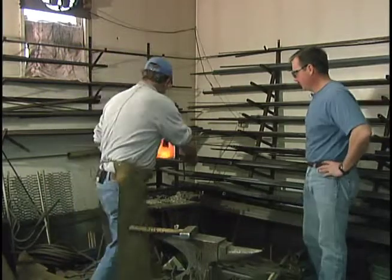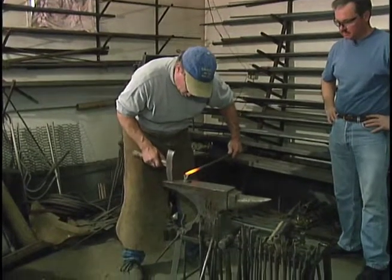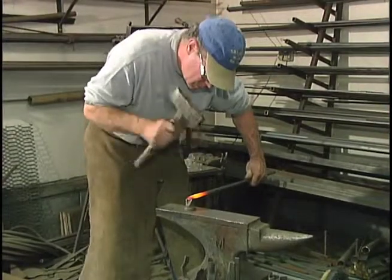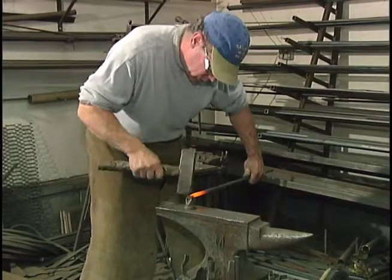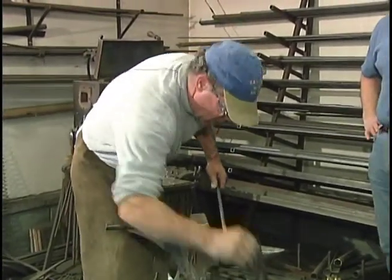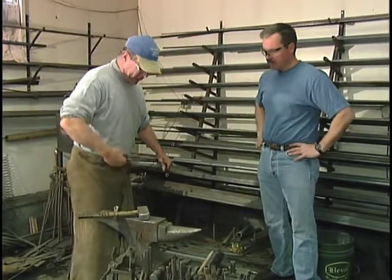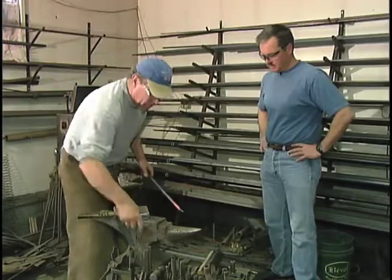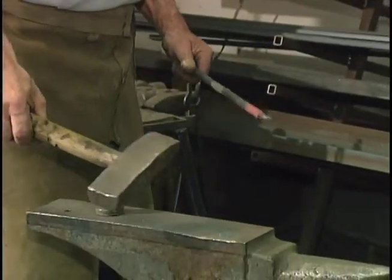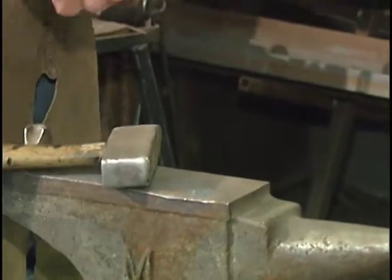Is that ready? Let's nip off a tiny bit of this. What's that tool? That's called a hardy and it's going to cut it. So that's definitely a traditional way of cutting steel. I have other ways of cutting — saws and band saws and bigger machinery. But this is what a blacksmith has probably used for the past few hundred years. Well, I only have two hands: one to hold the material, one to hold the hammer, and the anvil holds the chisel for me. This way it can be cut. So this little piece will be the one to catch the bottle cap.